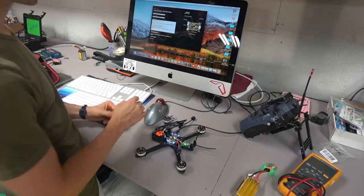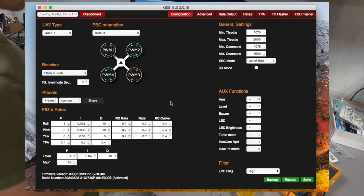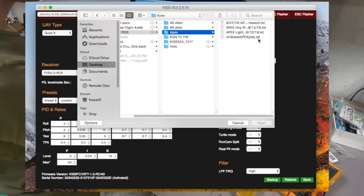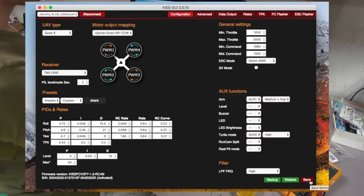So our ESC is now flashed, our FC is now flashed. See, it came back up on the screen and says we want to activate this flight controller. So yes, I would like to. Our receiver is almost done, but right before we get there, we can go up and put in these KISS PIDs. If we go to my desktop, go to KISS PIDs, go to Apex, and then 819, 812, 19, light. I have different PIDs for a heavy and lighter quad. I'll put both of those in the description. Those are the PIDs for this a little bit heavier quad. Actually, this one's not going to be running a 7, so I'll just run a Hero, or whatever. We can leave it. It's pretty much the same.